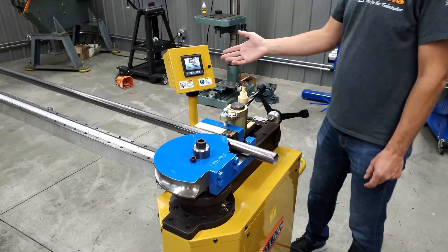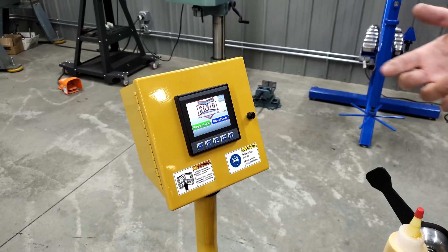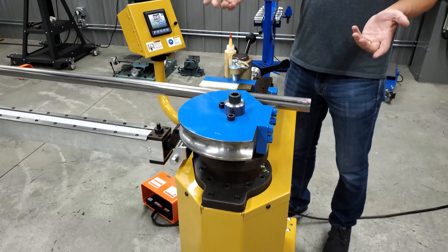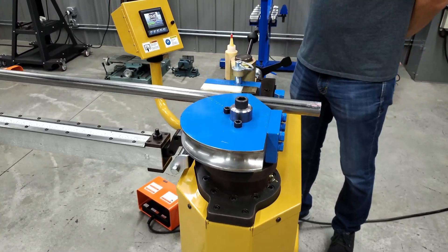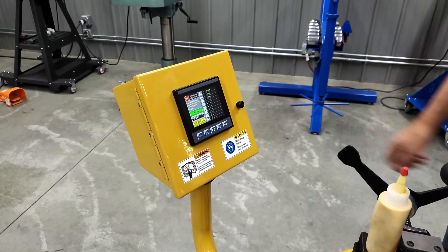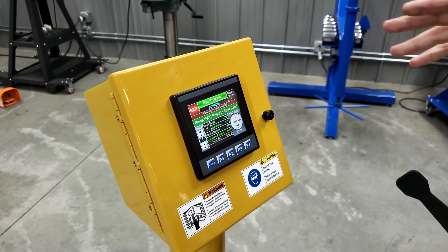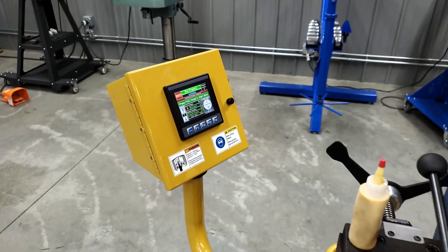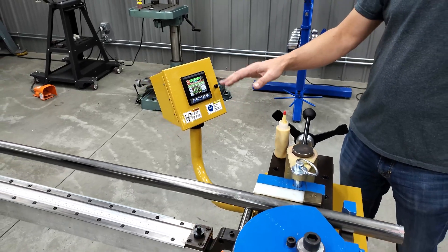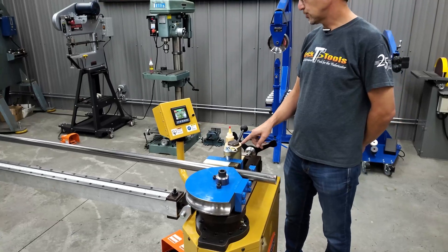In the control panel, you can see that we have program mode or manual mode. If you're just wanting to make a simple bend and match it to a template or another part, you can put it in manual mode and just easily and quickly make a bend and stop it at any point. If you're ready to start bending up multiple parts, you can go into programming mode and here you can see we've got some different parts stored. From there you go to run and there's your main bending screen. It gives you your bend angle, your spring back — which is something you figure out from trial and error and doing some measuring — and it allows you to put in any rotation that you might need between parts, as well as the counter die position. You can store all of that in here.